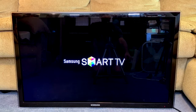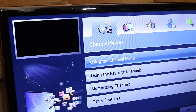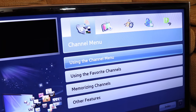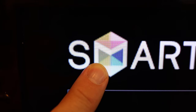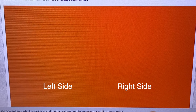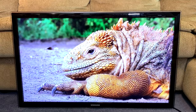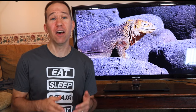Let's try this out and see how it goes. Everything is back together inside the TV, and when it turns on, all the lines are gone. A little piece of tape got rid of all the lines and the image looks great. The only downside is that if you get really close, there are some faint lines on the left side and colors that are not black or white can look a little faded — this is unavoidable because there's no signal coming from that side. But when I sit at a normal distance, I don't even notice. I brought my kids in to see if they could see anything and they couldn't tell. So for a small piece of tape, you can rescue a TV that might otherwise be thrown away.